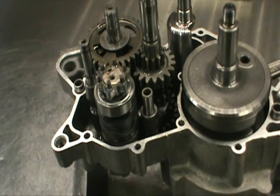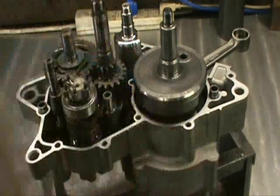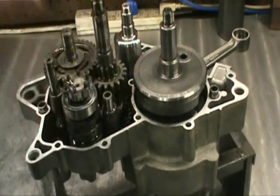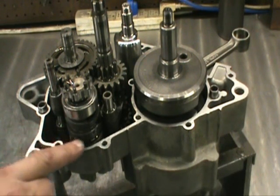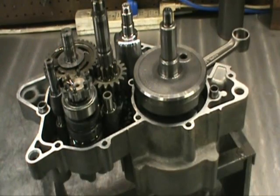Transmission is in — we checked it functioning properly. I went ahead and took my oil dispenser and put a bunch of oil in here, put a bunch on the cams, loaded all this up. You can't use too much oil in here — it's just going to drip out on the bench anyway. Next I'm going to take a paper towel, shoot some brake cleaner on it, and pat this area down. We've been messing around in here and I want to make sure everything is grease- and oil-free on the mating surface — so just take that precaution.